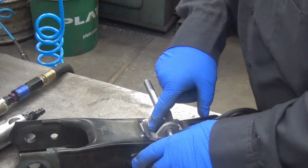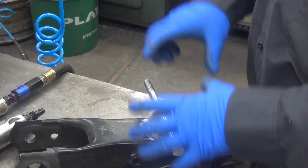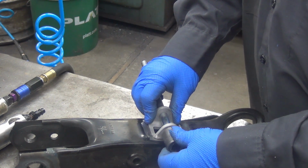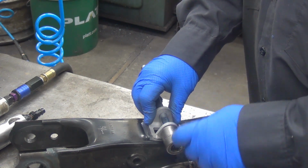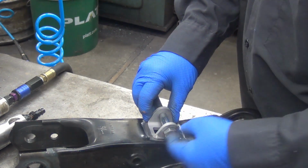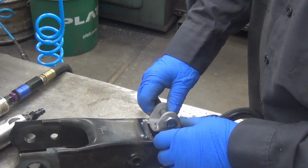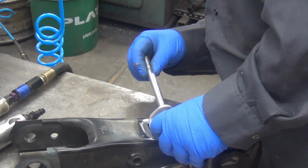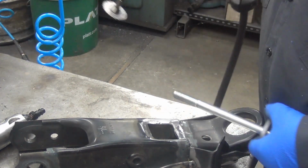Okay, that seems pretty close. It's sitting down pretty much where I want it in the back. I don't care that it's a little proud in the front here. I'm not looking to recess it, because I need to be able to put a socket on it. I'm using a thick-walled impact socket as a gauge, but the reality is most people are going to be using thin-walled regular sockets, so I think that might be close enough. Yes, I could just go grind more on the shock mount as opposed to the disc, but I'm here with the disc, so.